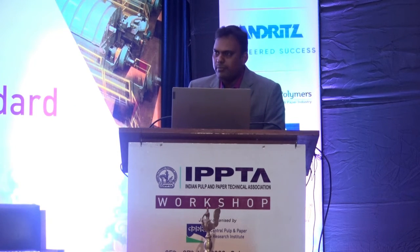So based on all this experience, we have made this the standard concept and benchmarking. If we talk about the cooking plant, normally we have two digester vessels, or we have three digester vessels. Three digester vessels are based on the production. When you are going to produce more, then you can go for three digester vessels, depending upon the production. Otherwise, two digester vessels are enough.